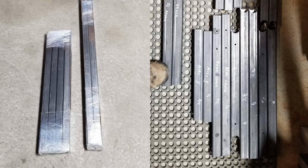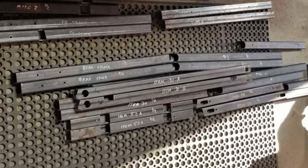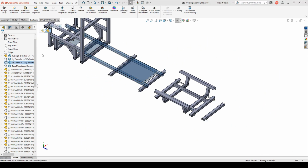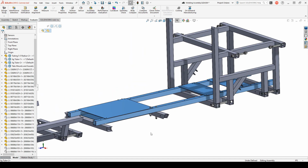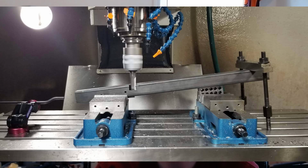Looking at the square tubes first, a bunch of these have various holes and slots, different features that mate with the bushings and the other parts that we talked about last week. Some of them even have these Lincoln log-like cutouts that allow them to be assembled easier. They also have a bunch of tooling holes that we use to locate all of the sections of the frame relative to each other, so having all of these precision machined was definitely important to keeping all those relationships intact.